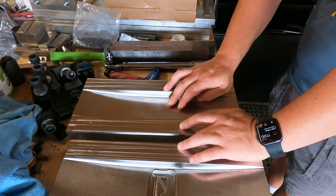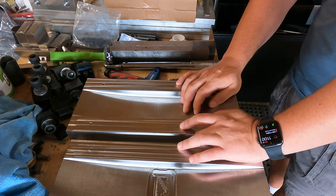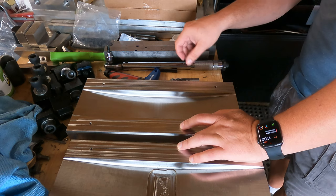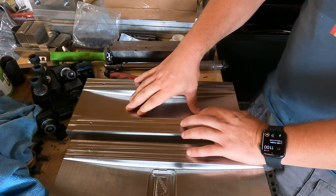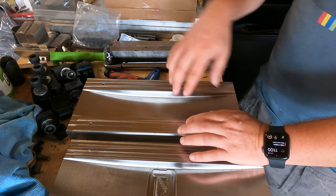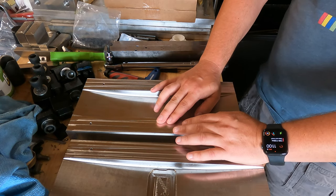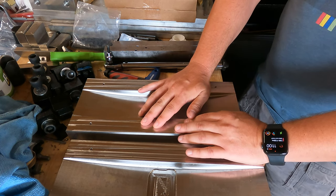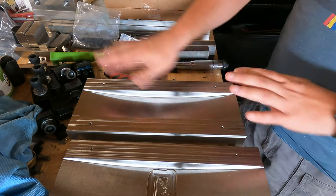So what did I do? Over time I started inching up the feed rate with the feed rate override. At two and a half thou, this is a half-inch cutter, so that comes out to 20 inches a minute. Well, I had it up to 30 inches a minute and it was still just cutting beautifully — roughing all this out, cutting beautifully. I knew I had a lot more in it, so I changed my code to run it at 40 inches a minute, and everything worked fine.